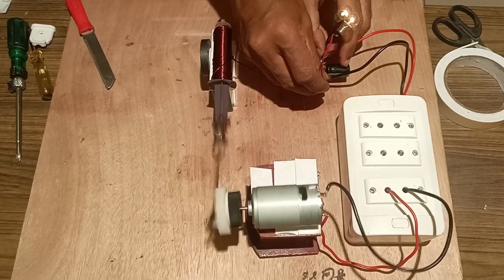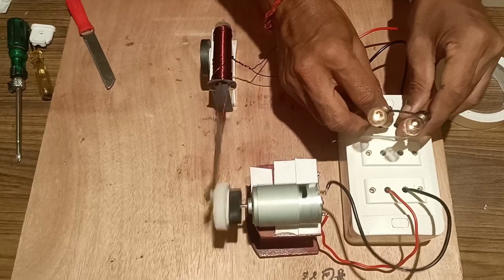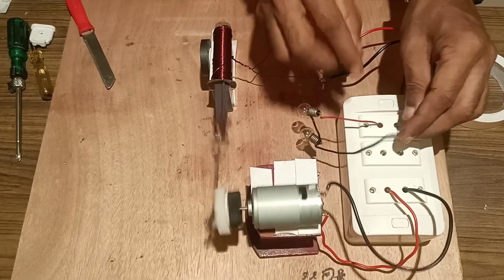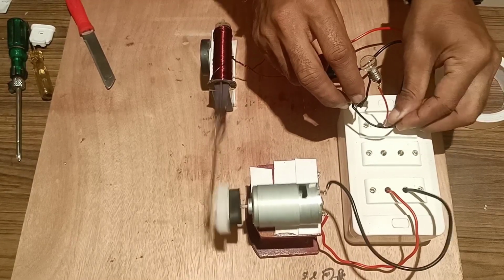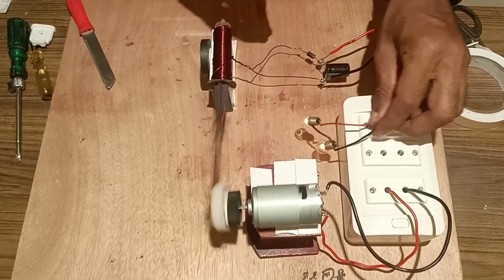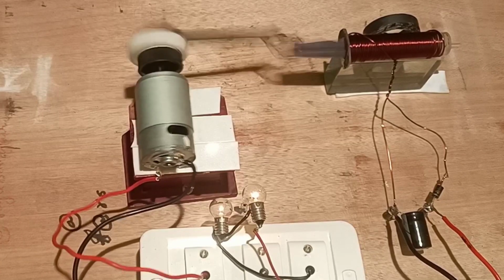The output of the coil works on the principle of Faraday's law of electromagnetic induction, stating that whenever the flux in the coil changes, energy is generated. Here the magnet moves to and fro inside the coil, where the flux linking the coil is changing and it produces EMF in the coil. The output of the work is that EMF is generated in the coil.